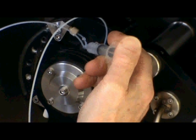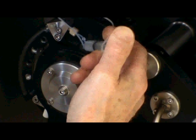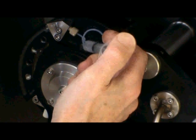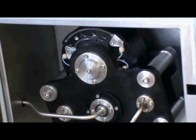Pull the second flying lead guide through using a small amount of silicone grease, the same as before. Make a note of which column it is attached to and label up as before. Do the other side of the bobbin the same as the first. Insert the flying lead guard and the flying leads and attach to the bobbin as before.